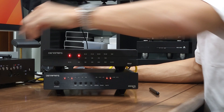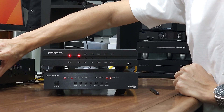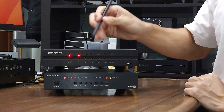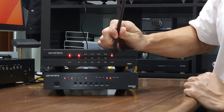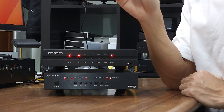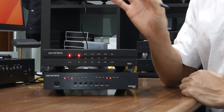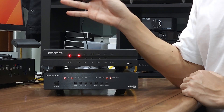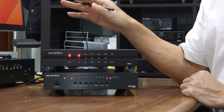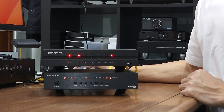Remember to connect the XLR cable output to the preamp or amplifier so you can hear the Aries 12. Turn down the volume and hit play. Right channel PCM plays correctly. Next is DSD — DSD LED is on. We notice the right channel DSD is playing incorrectly on the left channel. Left channel PCM plays correctly.